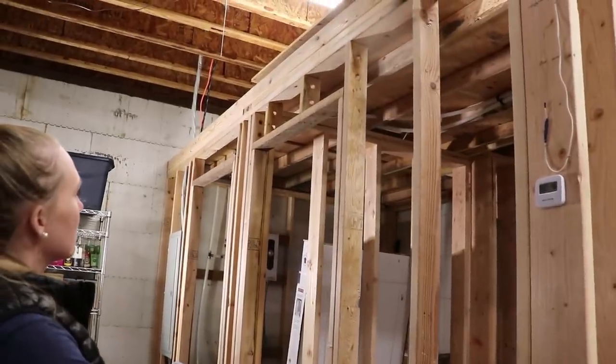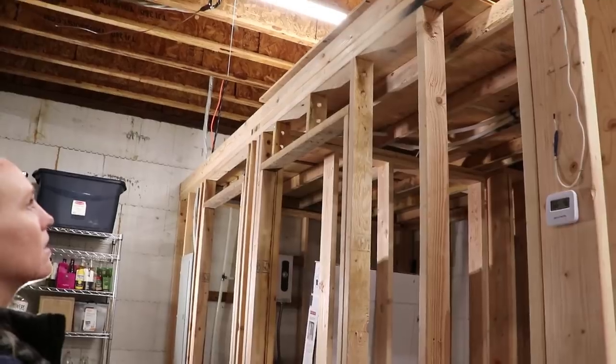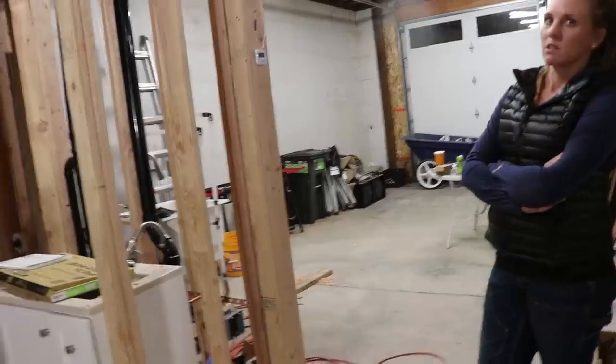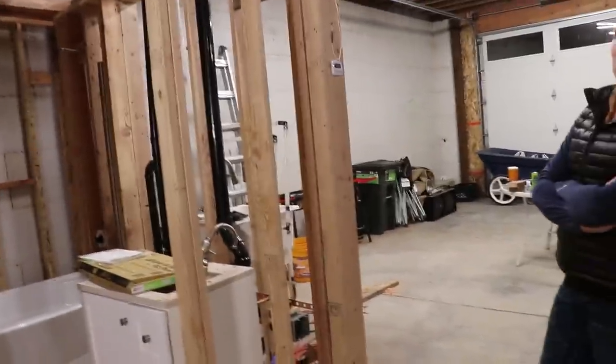And for the upper holes, true story, I don't even know why I'm running those. But anyway, they actually go over to this wall. And we're going to go across this wall. And then we're going to come up into the roof. And we're going to go across to this light box right here. So yeah, just start there. We'll do a home run. Then we'll do a home run from that outlet box back. And then we'll see where you're at.